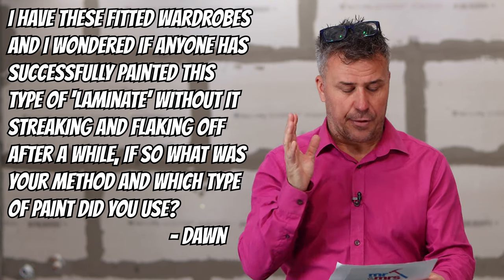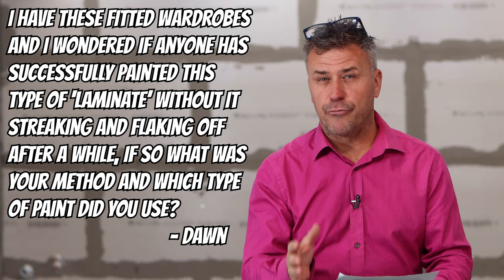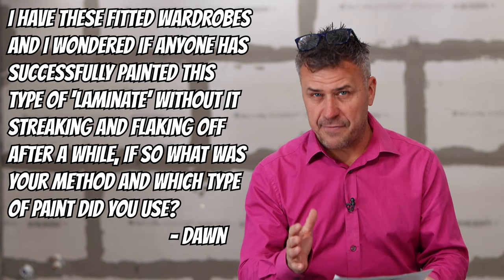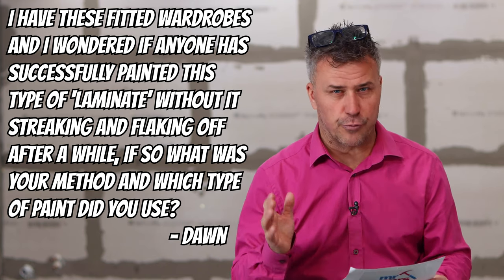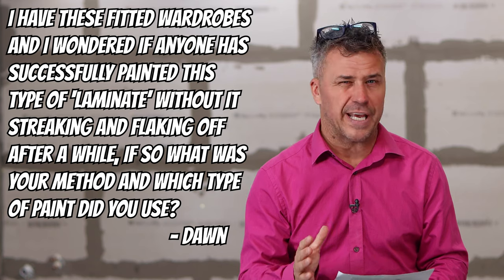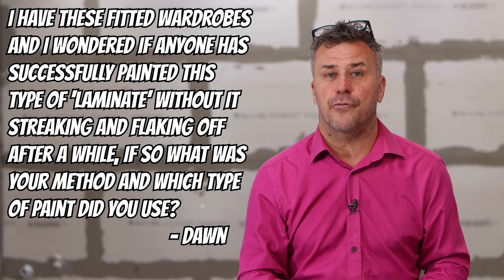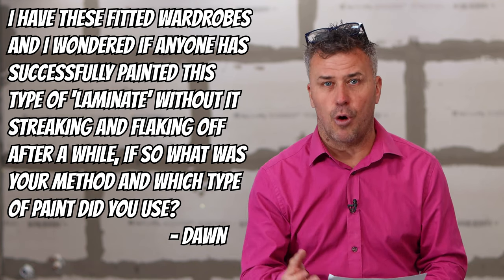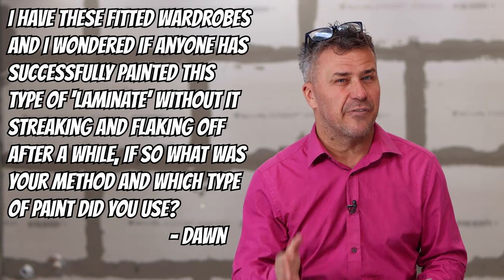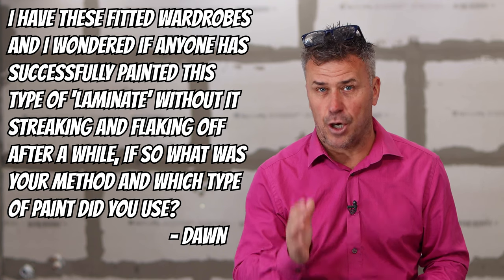Okay Dawn, there are a number of paints you can use. What I've personally used on kitchen cupboards, bedroom units, and various types of laminate, melamine and plastic-type surfaces: firstly clean them all down with some sugar soap, rinse them through and dry them. Then give them a very light scoring with sandpaper — probably about 180 to 240 grade — just scoring the top of the surfaces. Then I've used Frenchic's Alfresco Paint. You can apply this with a brush, roller, or paint sprayer, but you must do a minimum of two coats with a brush and roller, or three to four coats if you are spraying it, leaving two to three hours drying time between each coat under normal conditions.